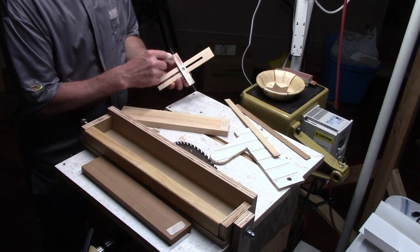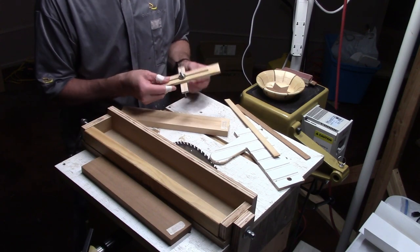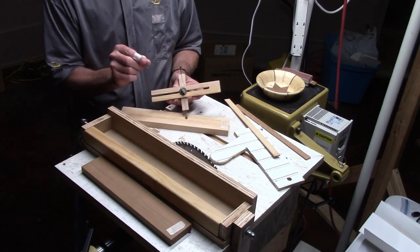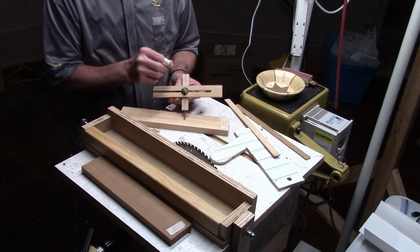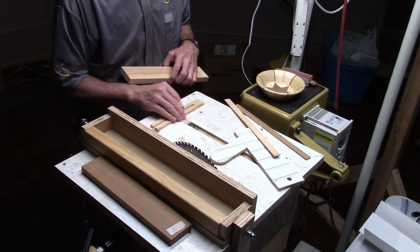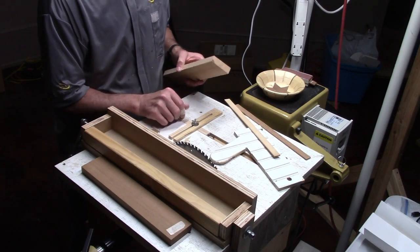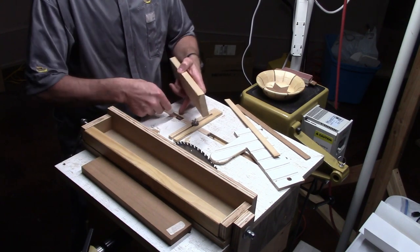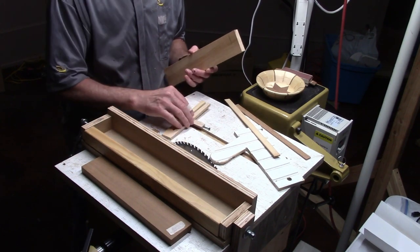And all this is a piece of wood that I've cut a kerf. Can y'all see that? There we go. There's a small kerf cut through here so this piece of wood can expand. I drill a hole and put a screw in there, and as I tighten that screw, it expands the wood, and I can get it to fit to whatever tightness I want, but it won't wobble around. As that gets worn out, I just tighten the screw a little bit until I have that screw run all the way in there. And then as soon as I hit that bell, it'll still tighten up. So this thing will last a long time.